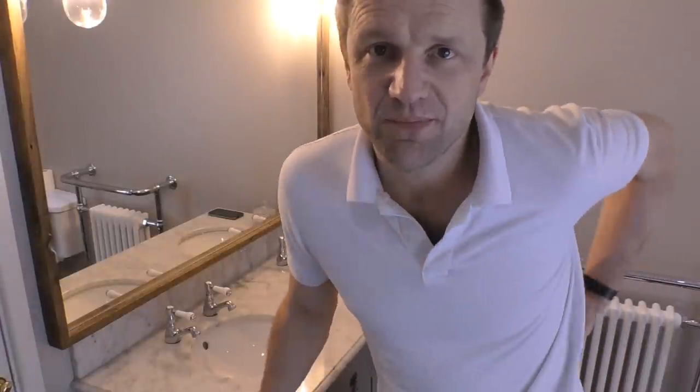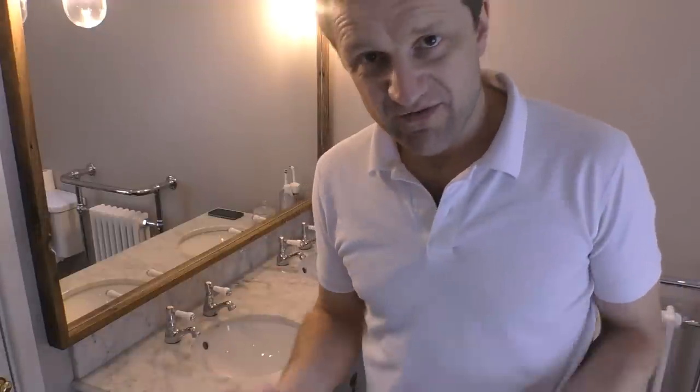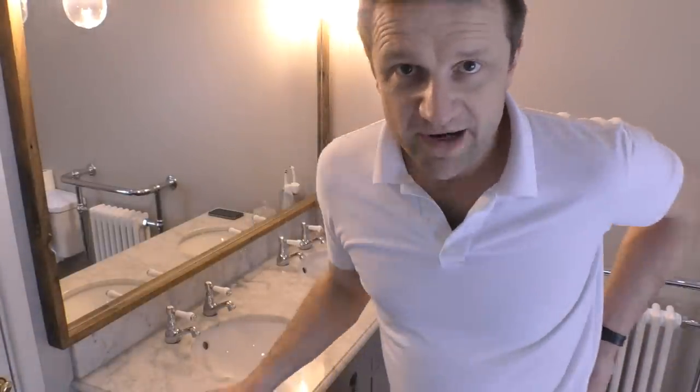I really hope you found this video useful today. I know it's a gross, horrible job, but sadly it's one that we have to do in our homes more often than you'd like — probably every six months to a year or so — because bathroom sinks get a lot of flack from toothpaste, face wash, and all those sorts of things. So it's a good thing to regularly maintain the bottle trap, S trap, P trap — whatever is underneath your sink — because then you know that slime and gunk isn't moving further down into the waste pipe system, which could give you more major problems to clear.